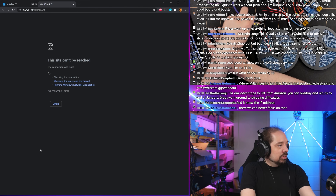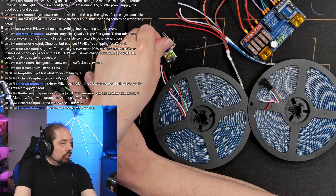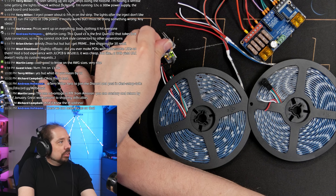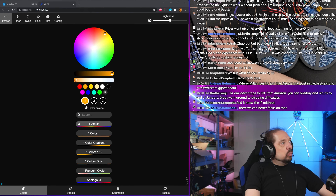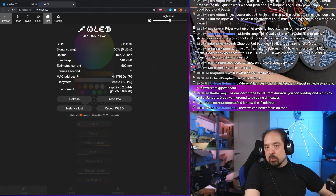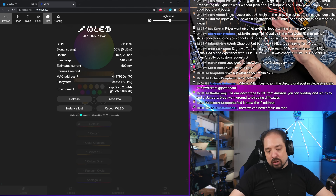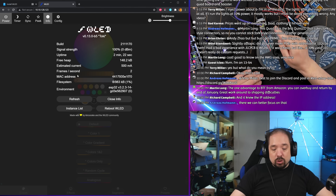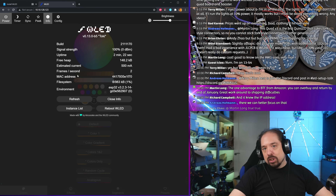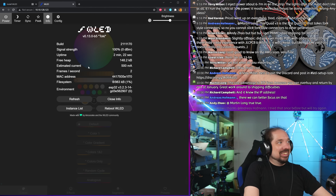There we go — blinking Ethernet. If I now check my router logs, I can see it got an IP on my local network. And there we go — we now have WLED connected over Ethernet. Using the Ethernet version is really simple: connect over Wi-Fi or as an access point, go to Wi-Fi settings, select QuinnLED ESP32 Ethernet version, and that's it. Ethernet becomes active and you get 100% signal strength.